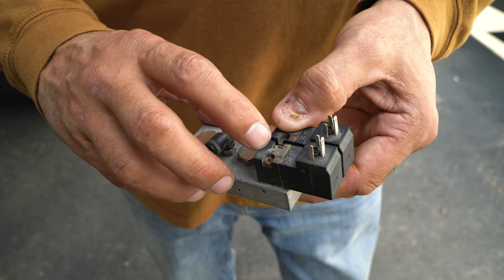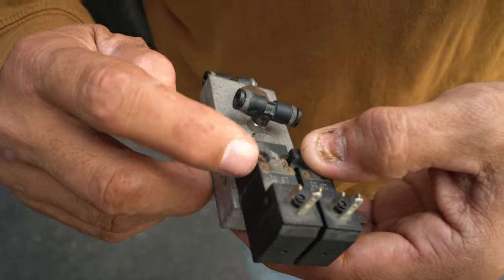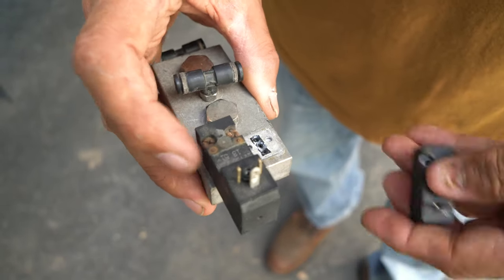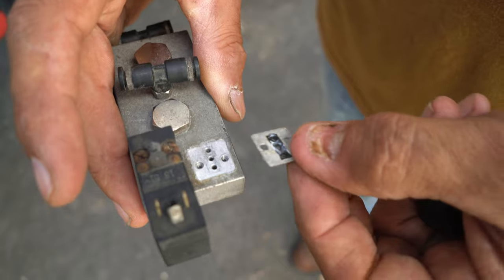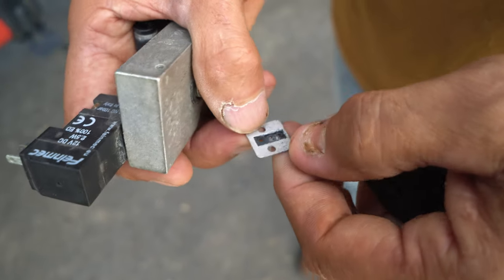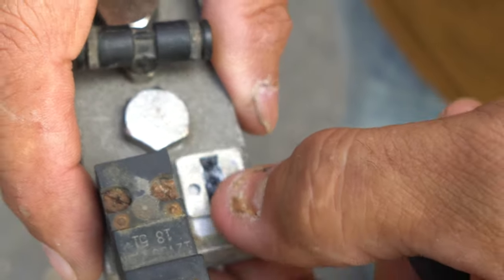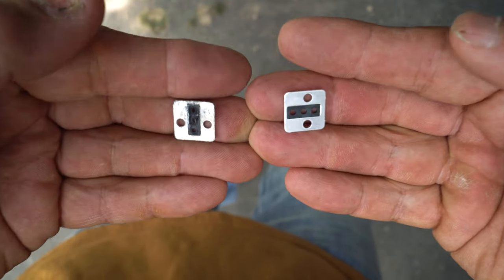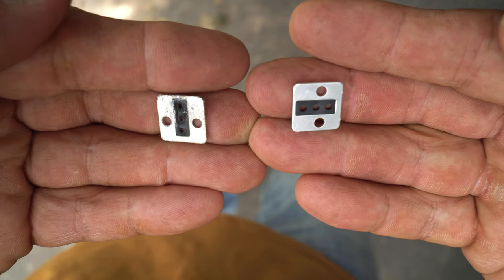What happened was my number one compadre down there was trying to take these screws out and they wouldn't come out. Because if you notice, there's a rusted stainless steel bolt and that's aluminum — that's called dissimilar metals. When you get dissimilar metals together, you get corrosion and white powder, and you're going to have a problem. He put a little bit of silicone on there — I would actually use Noalox, which is in the electrical aisle at Home Depot. Put a little bit on there and it'll stop it from corroding. And you see these little holes in there — they get oblong. The shiny one has round holes; the left one has oblong holes — that's why the hoist wasn't working.